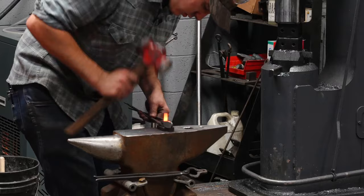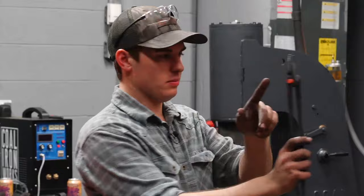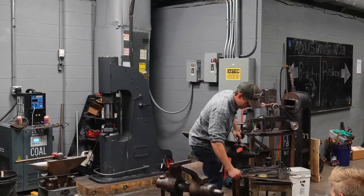If that rivet starts to kink, don't go further. So, look here. We've got a 1/2 inch on the bottom. On the top, it's a little bit more than a 1/2 inch. All that means is that these bosses are slightly thinner than 3/8, and they are. I can fix that very easily, several different ways. In this case, instead of using the grinder, I'll show the no grinder method.